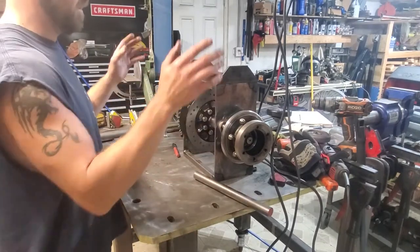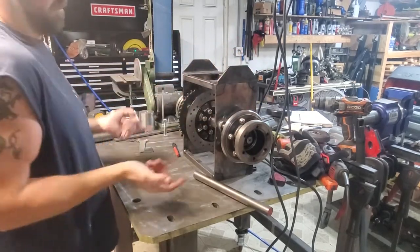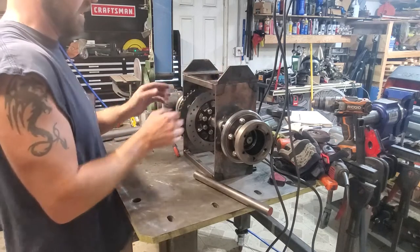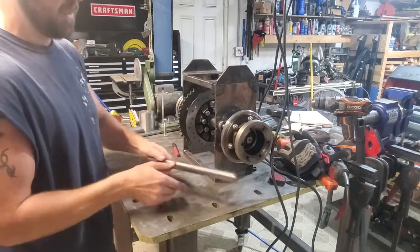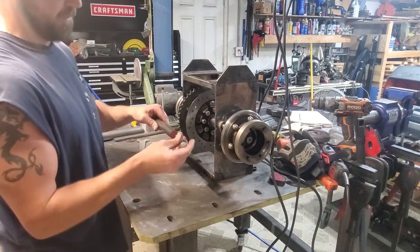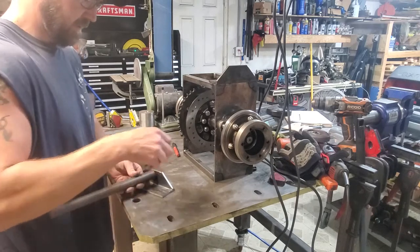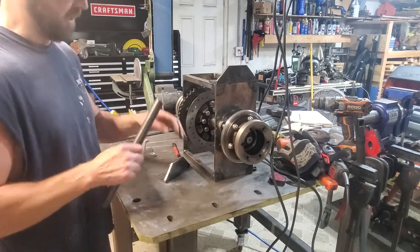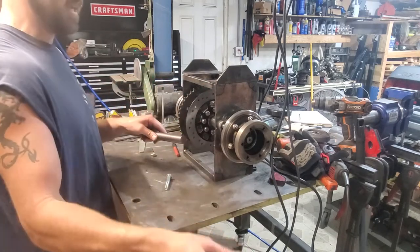Picture, if you will, that this is the bottom side. I want this thing to pivot on the bottom, and then on the top I'll have two attachments that I can tighten the nut on and move this thing slightly back and forth so I can tension the chain. What I want to do is basically weld these brackets on the bottom. I'm going to take this pipe and bore a hole in it so it'll fit this bolt through it. And then I'll cut some short pieces — this piece will mount to the frame, then the bolt will go through these brackets, through this, and then a nut on the other side. So I'm going to go bore a hole in this on the lathe, then we'll cut it to the size I want and make some brackets and mount that to the frame.